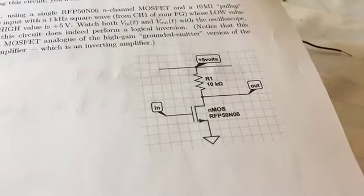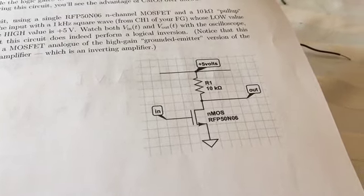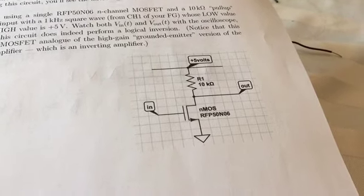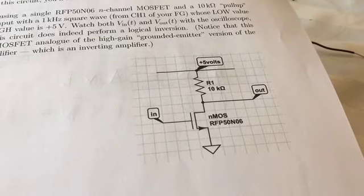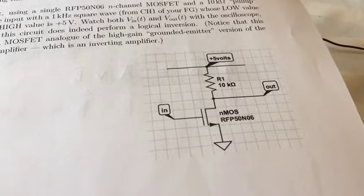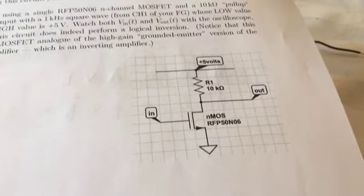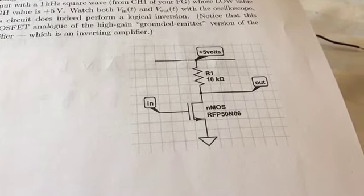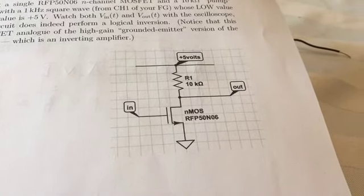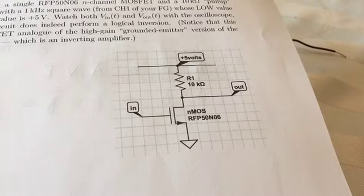And actually my first microcomputer, a Commodore 64, was based on the MOS 6502 or the MOS 6510 microprocessor, manufactured in Norristown, Pennsylvania, not too far from here, by MOS Semiconductor. So it was not CMOS, it was an NMOS device. That was a pretty slow chip, but that slow chip was good enough to power not only the Commodore 64 and the Commodore VIC-20, but also the Atari 2600 game console and all of those old video games from the 1980s. All right, I think I'm already over my 10-minute limit.